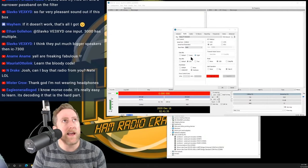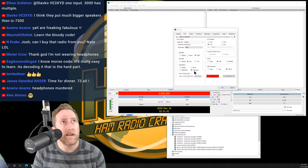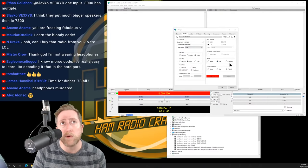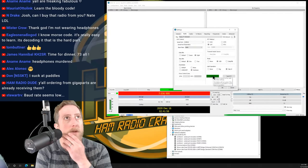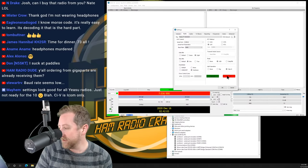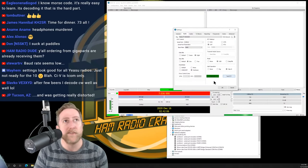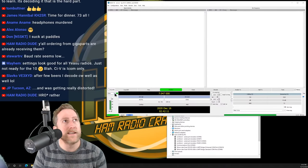Okay, so 8 for the data bits. Stop bits is 1. Hardware is for handshake. CAT is what we have selected. We're using upper sideband, although I'm assuming it would work in data packet. And split operation is fake it. Oh, we got it. Okay, let's try. Yeah, buddy. Okay, we got it. And it's reading.